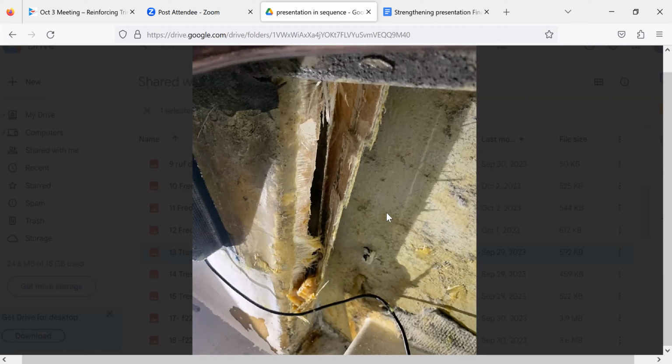The carbon looks intact. Just saying. Before you rip the boat apart. Well, to go back to the problems with the beam, with the ring frame and the port bulkhead and the tabbing and all that business. I've wondered about this too. If you have a production boat, how do you know what the status of those hidden structural things are? You could tap it out. You take your little hammer and tap all the tabbing. That actually might be useful. Cracks are always a good indicator. Cracks are a great indicator.